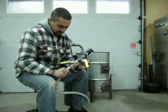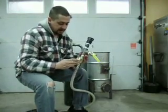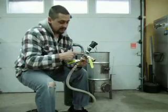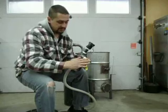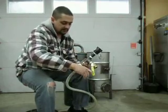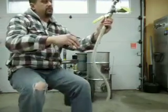My carburetor is nothing more than a couple of three-quarter inch ball valves. Your gas travels through this hose — this is your gas ball valve, controlling how much wood gas you want to give it. That runs into a T, and then out to another three-quarter inch ball valve — this is your oxygen. Because your engine pulls a vacuum through the center, it'll pull the wood gas and you add or take away oxygen to get it running at the correct RPM.